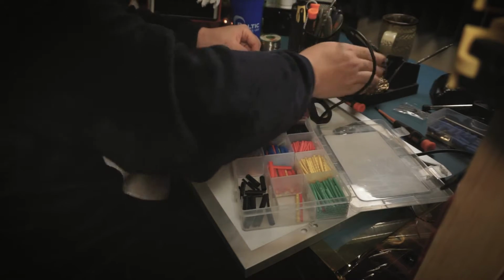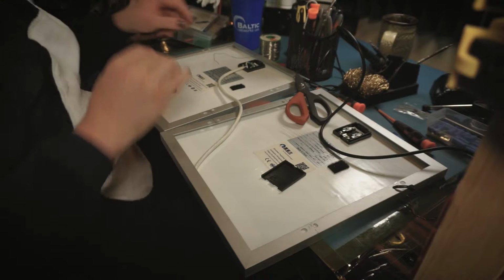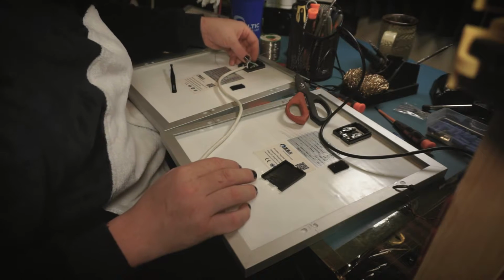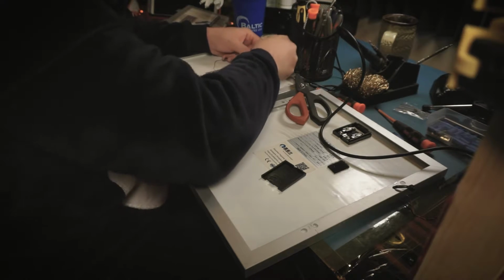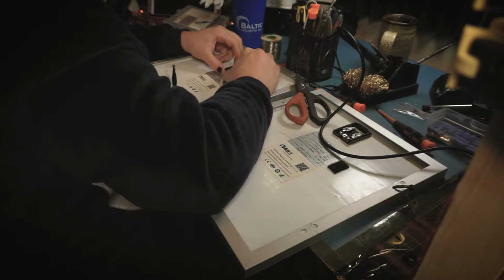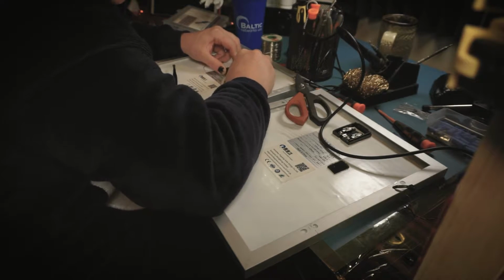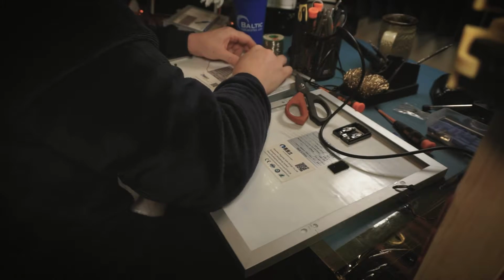You're basically binding the solar panel itself to the battery, which means that you can actually draw these down. So if you've got, like at nighttime, if you don't have a blocking diode, the solar panels will actually produce infrared light. They're LEDs. They're basically like TV remote LEDs. So these guys here can produce infrared light and they can draw your batteries down. So you have to be careful about that.